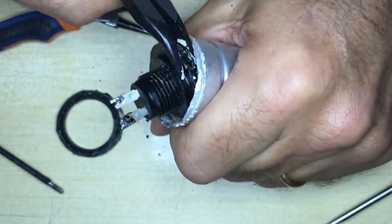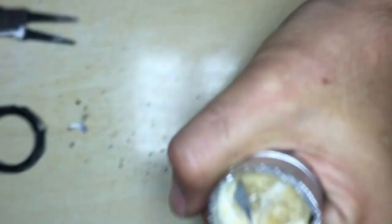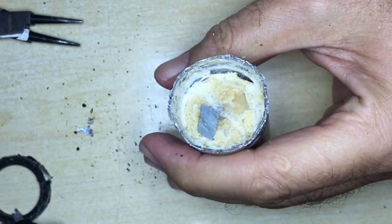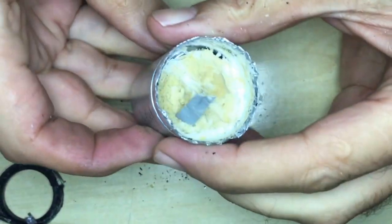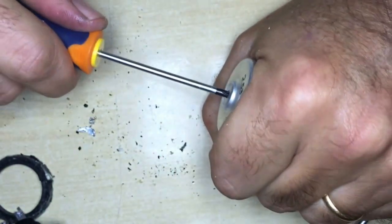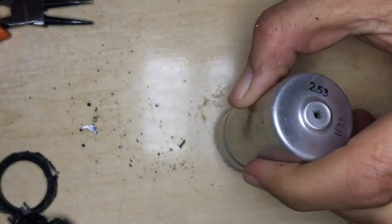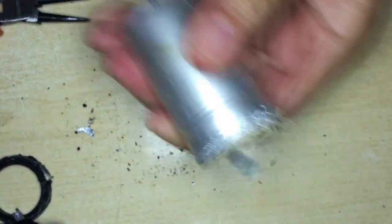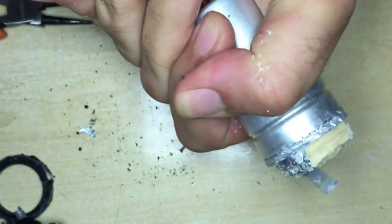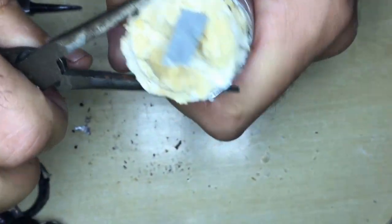What you're seeing here — the trim at the bottom is actually underneath the capacitor when it's bolted down to the chassis, so in all likelihood you will not see that. The thread and casing is now open. You can see the capacitor material. These caps used in the Saba radios have one advantage: generally they have a plastic hole at the top which makes it easier to push out the stuffing. Many people use heat to melt it and pop it out, which is necessary with some older caps, but not on these — you can literally push them out without damaging the casing at all.